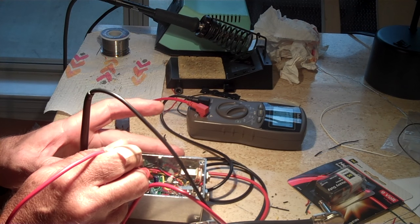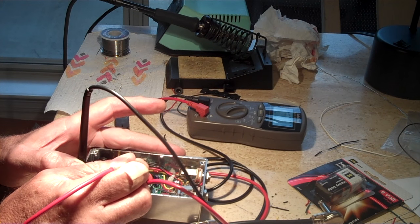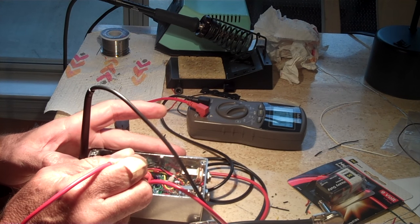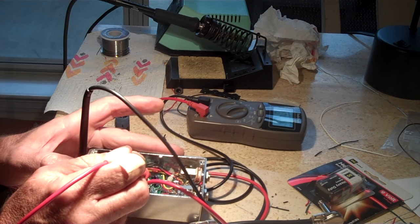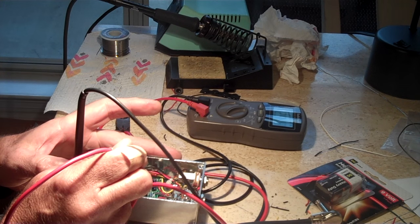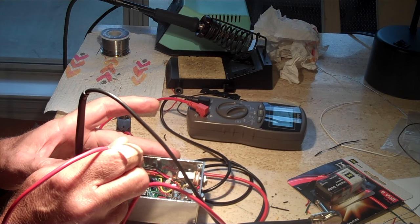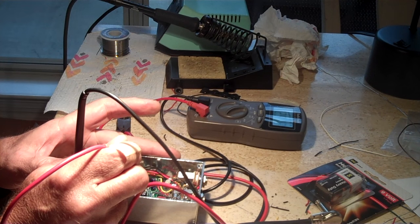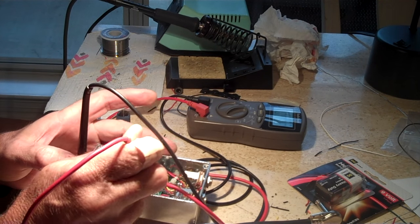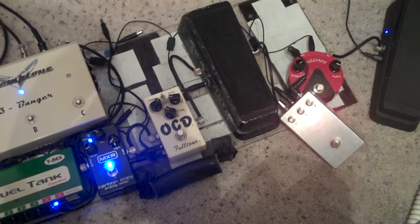Then this side over here must be the 4.3. That's the collector. That's dead on. 2.91, or they're showing 3 for the emitter. That's pretty darn close. So that's good. So let's check the next one. I had to check it first, and actually it sounds pretty cool.